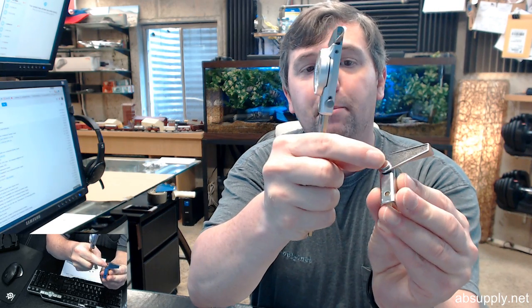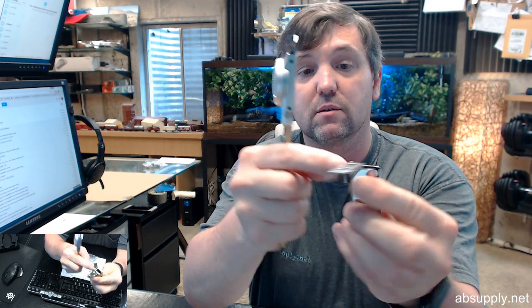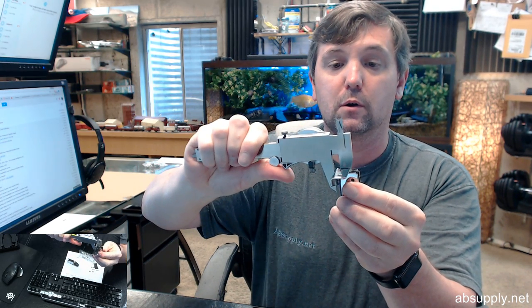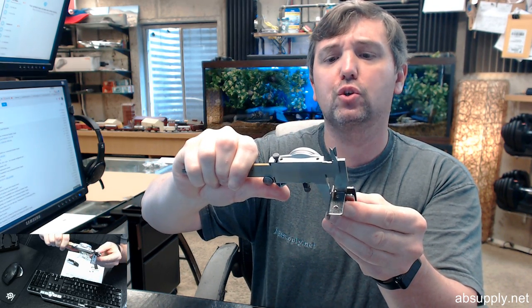So the distance from the bottom, or the thickness from the bottom of the rivet into the inside of where the glass will sit, that's going to be 0.245 inch. So assuming that you were going to hold this tight to the bottom and tight to the top, you'd have 0.245 inch times 2, so 0.49 inch, just less than 1/2 inch. I might be tempted to do a glass pre-fit in the height of about 5/8 of an inch.